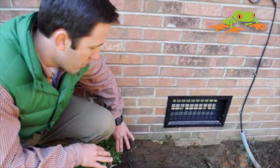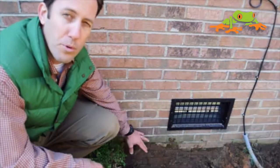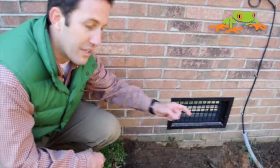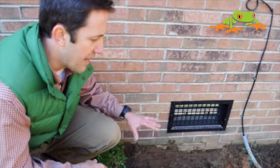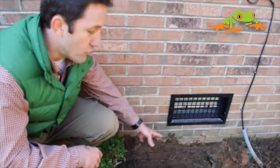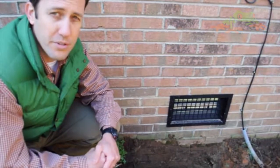So what we do here is clean off this wall, treat it with hydraulic cement so there are no holes or irregularities, then we put on a waterproofing tar liquid asphalt substance. Then we install a French drain here to get the water away, so that now you have a dry wall and a dry footer with constant drainage around your house.